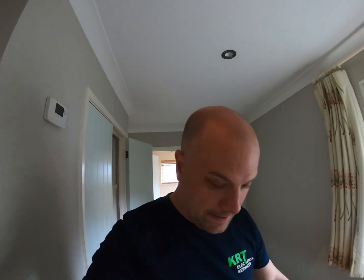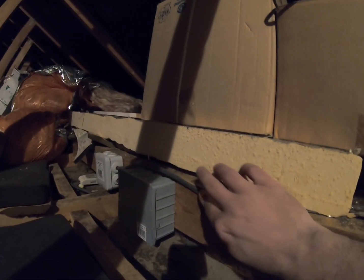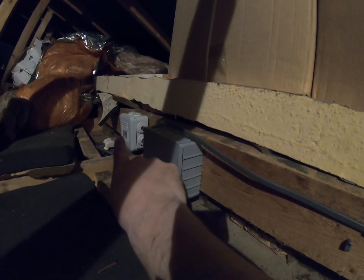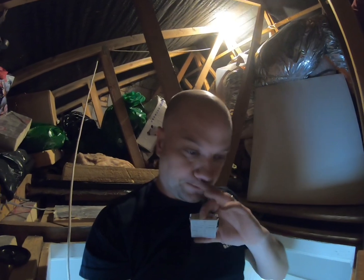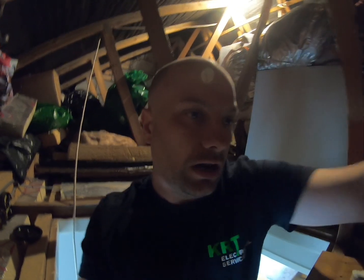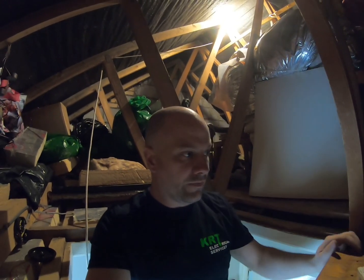It's the landing one as well, so again all we've got up here is the same box. I'm going to clip this cable back, label this up — kinetic receivers in there, feeds into that junction box which then feeds into that over there, goes down to the light. This cable down to the switch is redundant so I'm going to take that out. I'm going to label it all up, take some pictures when it's done, and then that'll be the end.